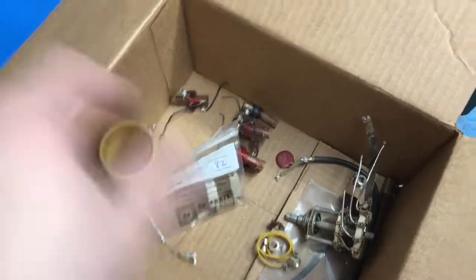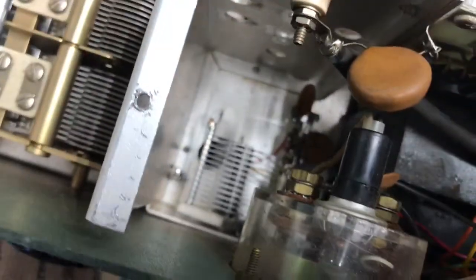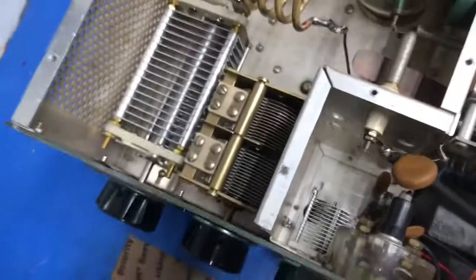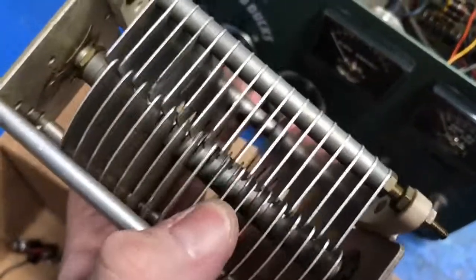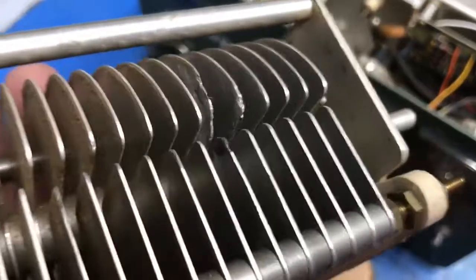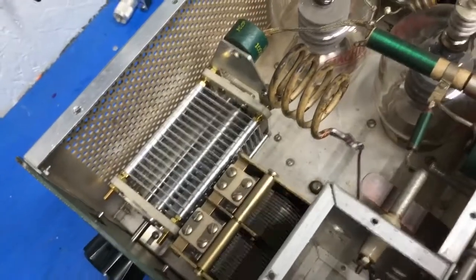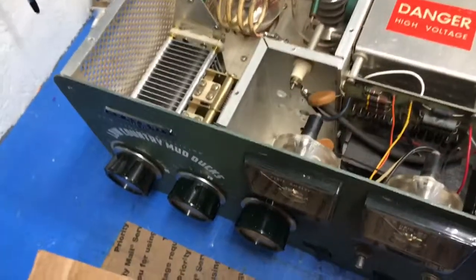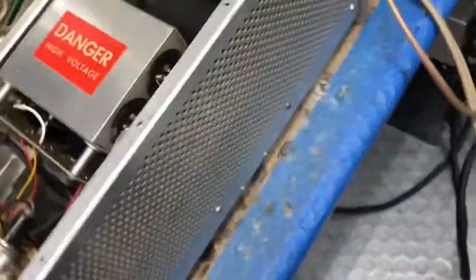I cut the coils and did my work to it - I do them different than everybody else. If you look at the front, the knob's still there. What I do is go down to the inside and put an input tune. Also, after we got that fixed, his tuner was arcing, so I bought him a new tuner, put it in, and added an input tune as well. I cleaned it up and brought everything back up to spec.